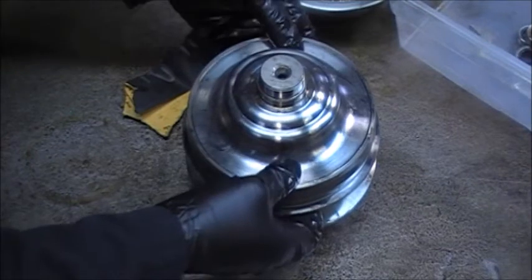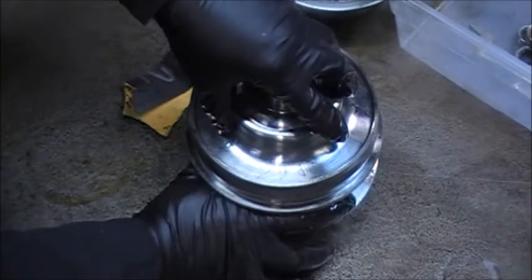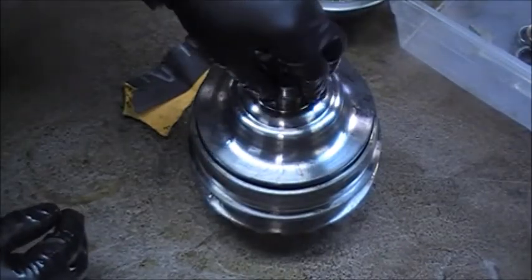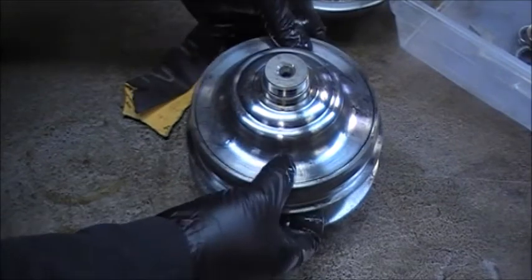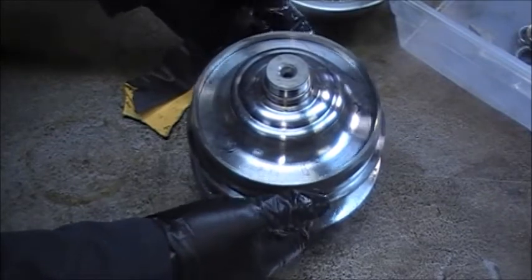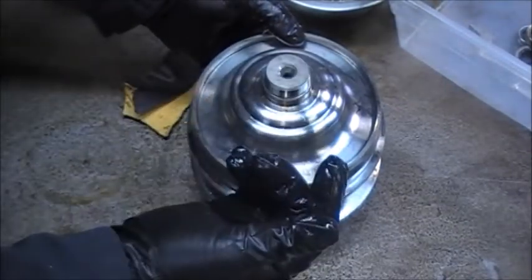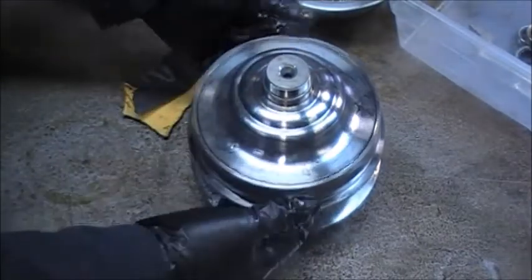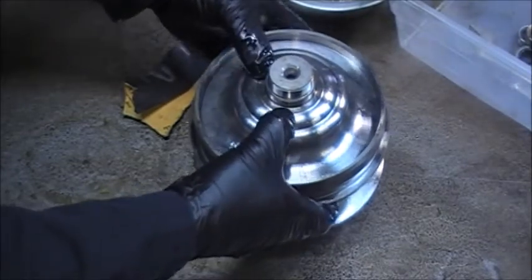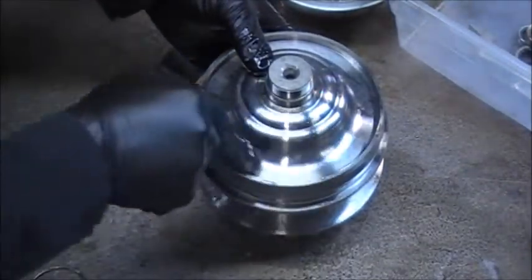So just raise it up. Make sure everything's okay. Once you've got the belt in there, you'll be fine. Put this in, put the bearing on, put the nut on, and then you're ready to go. Make sure this moves up and down easy — just like that. You remember when I moved this up and down with this off, the pins come out — they can't come out because this part right here is stopping them. And you don't have to worry about the balls ever breaking inside here anymore.